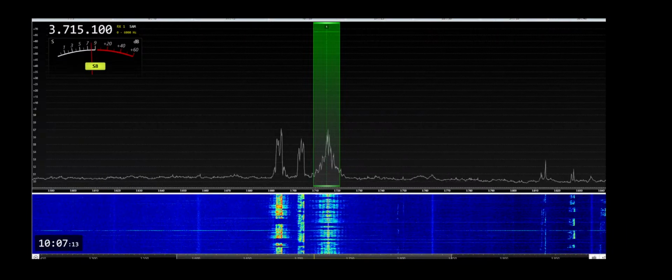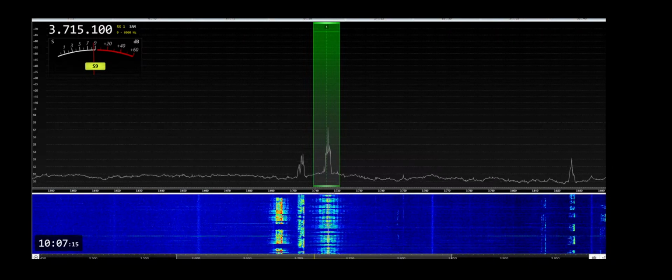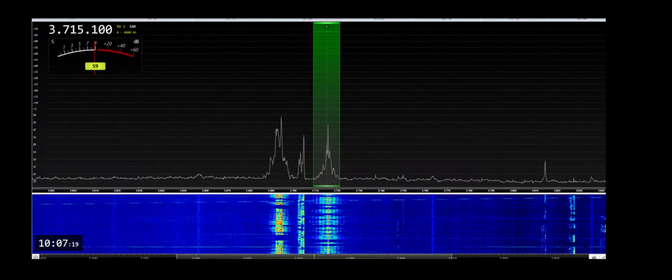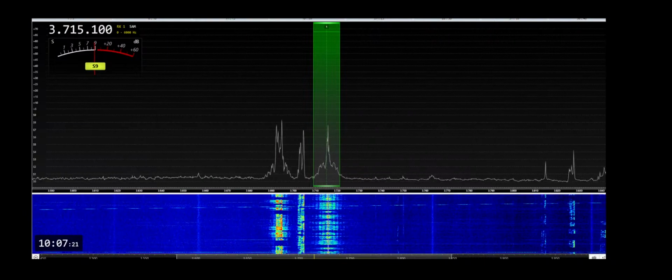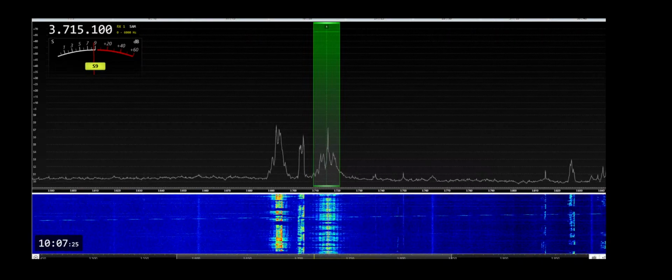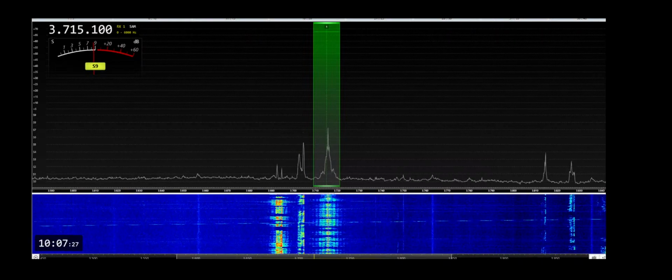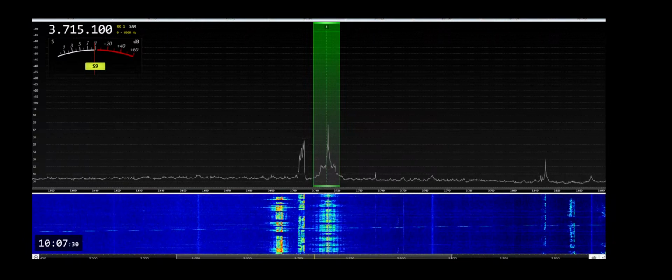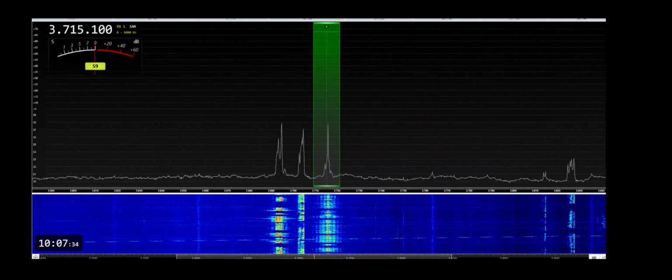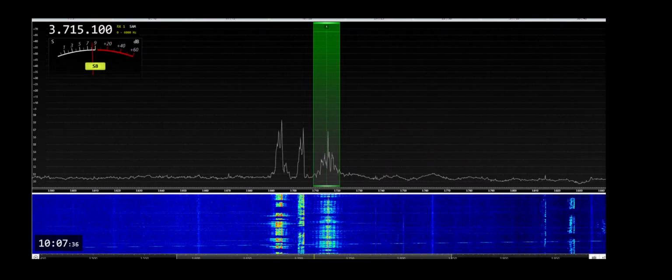But anyway, be that as it may. And I appreciate the comment Charlie made about the 30L1 and tuning it with that tune indicator. I had come to the conclusion that was also the case, that it only worked with the Collins equipment. And like I say, when I'm tuning grounded grid, I'm looking at power output as well as grid and plate current.